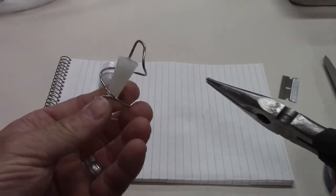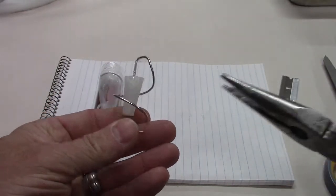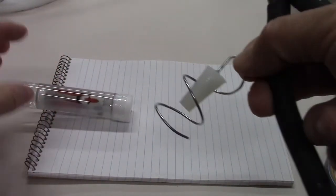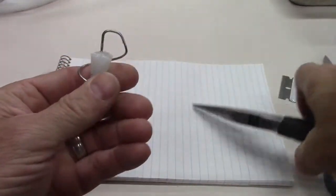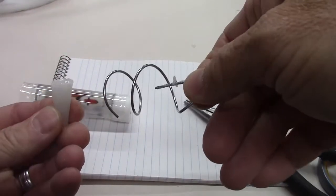So the next thing you want to do, sometimes the plugs will stick to your coil, sometimes they won't. Now this blank was actually polyresin, Silmar 41 polyresin. So what we can do is come up here and squeeze this tube. Just work around the edges here, and what that does is it breaks the resin free from the plug, and you're able to just pull it off.